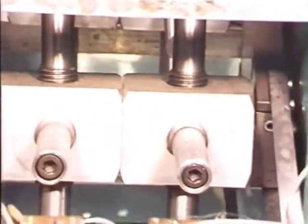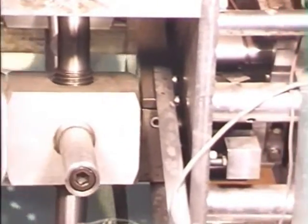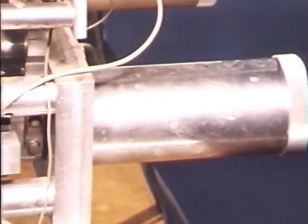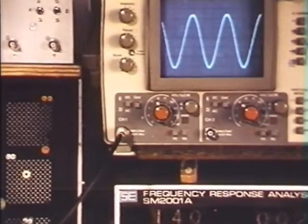That's a view from behind. You can see the edge of the torque motor and the arms which used to have big heavy weights on them. We now find it's better without any weights. And there's a biasing spring in a housing that can be rotated so that we can trim the model up and down.